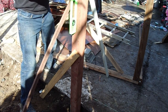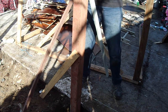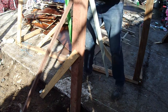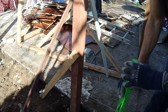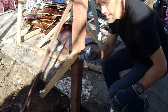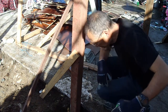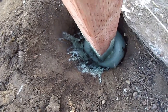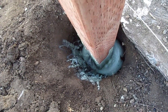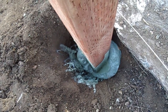After you've poured it, you want to double-check that the post is level. I'll give you a word of caution: you want to keep checking for level, because as that foam expands, it actually moves the post and lifts it up off the ground. I was quite surprised. In a minute, I'll show you a fast-speed video where you can actually see the post lifting up. You can see it — and I don't know what the ratio is, maybe a thousand to one, how it expands — within three minutes it'll be fully up.